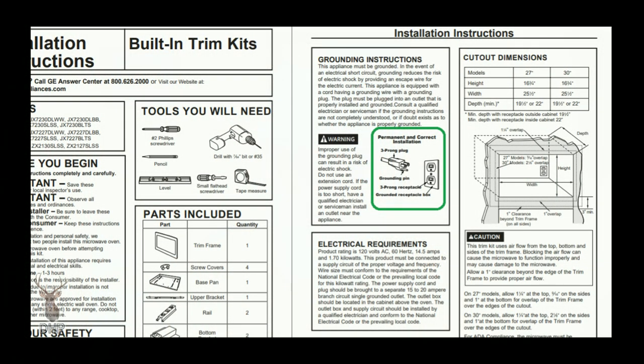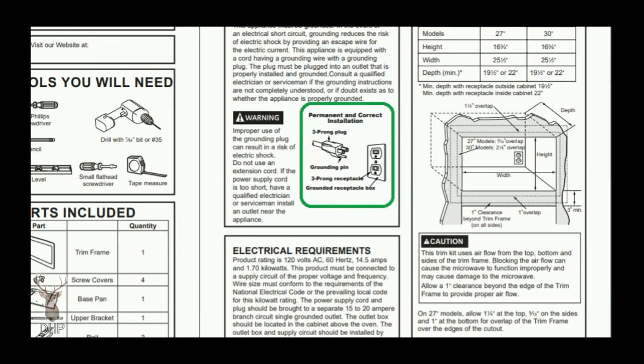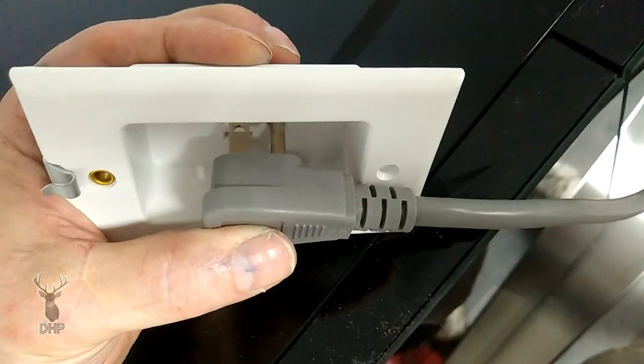If you download your installation instructions before buying a $600 microwave, you'd look at what size cutouts match your cabinetry. We noticed the illustration had a straight plug, which is why we used a clock receptacle rated 15 amps — to gain about an extra inch of depth so it wouldn't take up too much space. But the microwave actually had a right-angle plug, and because of the length of the strain relief, we had to swap that receptacle for a standard duplex facing toward the inside of the box.